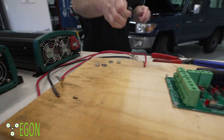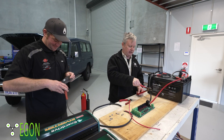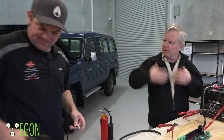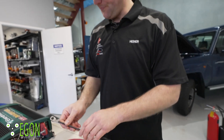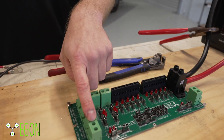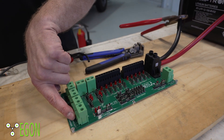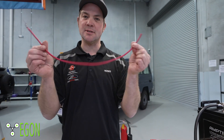We've got two 2-kilowatt inverters, and we have a disconnect to isolate the battery in an emergency, and a fire extinguisher behind us just in case. The cables we're using to hook up the inverters are way too small for what we're doing — we are aware of that. The only reason is because we are limited with the connection terminal size on the DC hub, since this is not meant to have 200 amps going through it — it's only set up for 60 amps. The biggest cable we can get in there is 6mm², or two 8mm² cables, and that's what we are using.